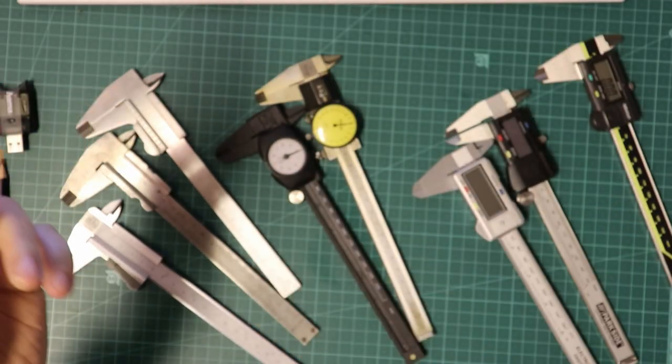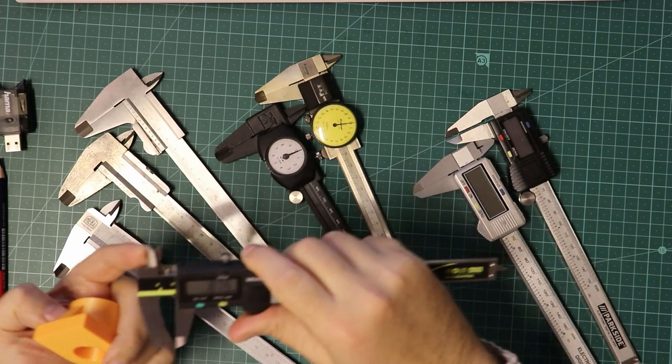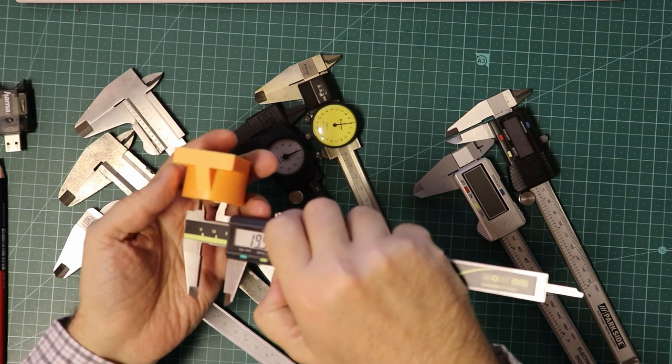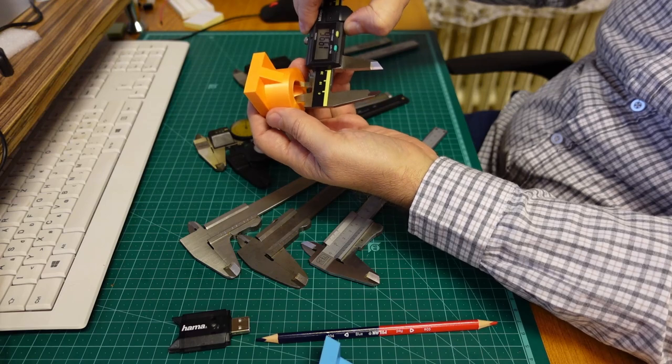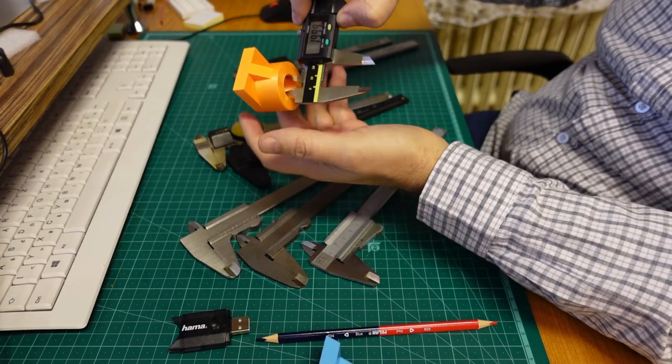Especially with pressing — pay attention not to press too strongly, because with that you can get even three or four hundredths of a millimeter less. That's why I rather like the micrometer, which has a limiter so I cannot over-tighten it. But this is not the subject of this video. The small jaws are sharp and are usually used to measure inner dimensions and very commonly inner diameters. It's a little bit tricky — you have to move it slightly, paying attention to measure at the center where the bigger value is.